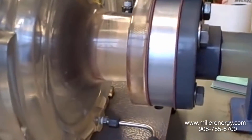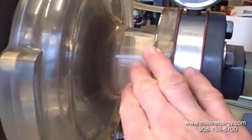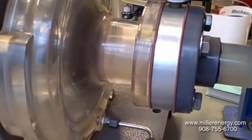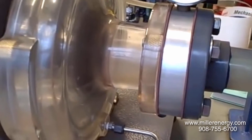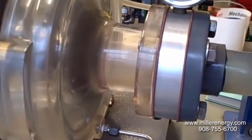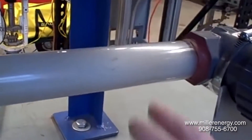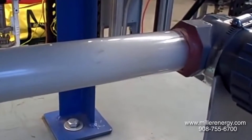You can see it happening here. You can also see some bubbles here at the scroll casing of the pump. Cavitation is very destructive, especially upon metal surfaces. The acrylic surfaces here seem to handle it a little bit better, but with metal surfaces that don't give, it's very destructive. The metal becomes pitted by the high-pressure jets formed by the collapsing bubbles.